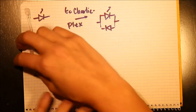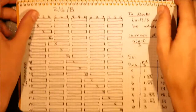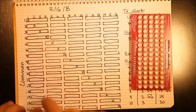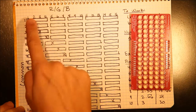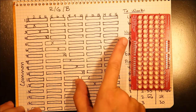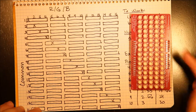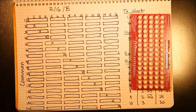So in order to figure out how to do this, I actually ended up drawing this diagram. And this PCB is actually this diagram laid out this direction. And the numbers of the pins are not exactly the same as you would use on an Arduino. Specifically, pin 13 has a light on it already, and pin 0 and pin 1 are already being used for RX and TX. So I used other pin combinations, but logically it's the same.